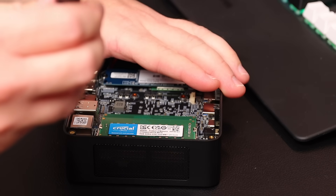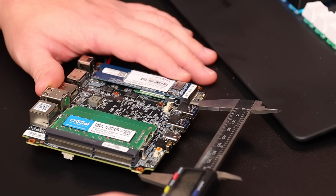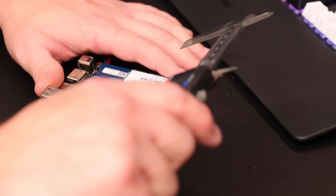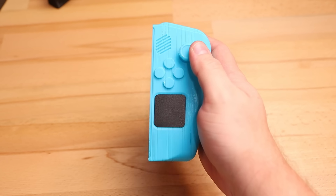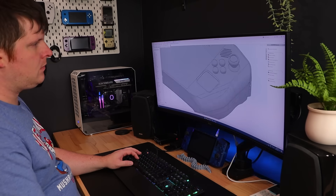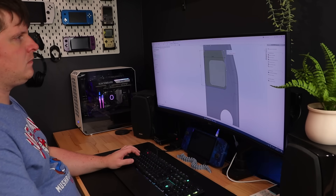With all of the decisions out of the way, it's time to start looking at the design. The first thing I have to do is disassemble the mini PC and measure up the components so I can include them in my model. I also need a model of the display, but fortunately Waveshare provides models, so I just downloaded theirs. Now that I have a rough idea of the size and shape of the console, I'll do some test prints to check the position and feel of the controls, adjusting and repeating until I'm happy. Once I'm happy with the shape and control positions, I'll hollow out the housing, split it in two, and add all the mounting points. Because I'm not using a standard controller layout, I've got to design my own controller PCBs, so I whipped up some designs in KiCad and sent them off to this project's sponsor, PCBWay.